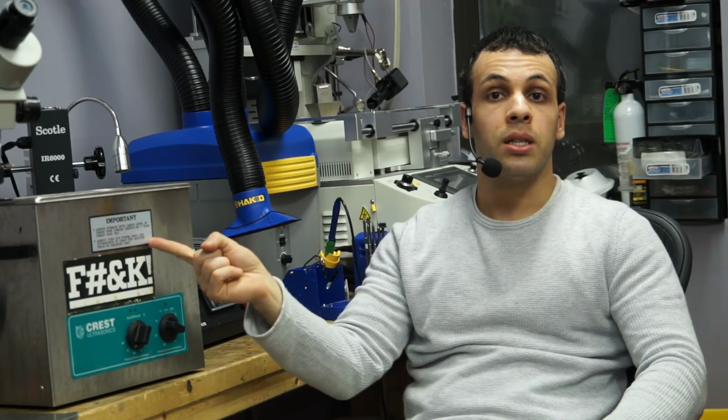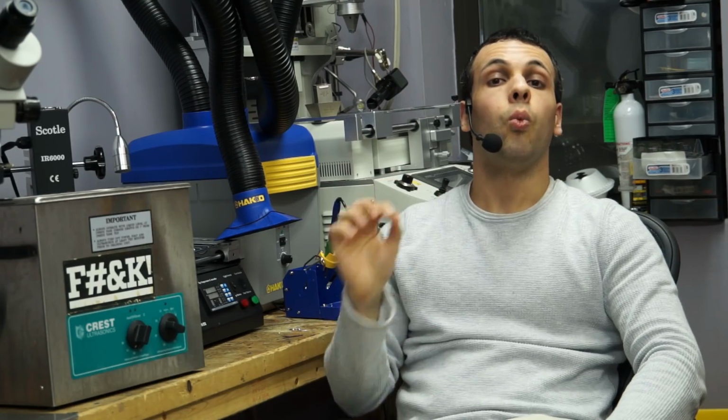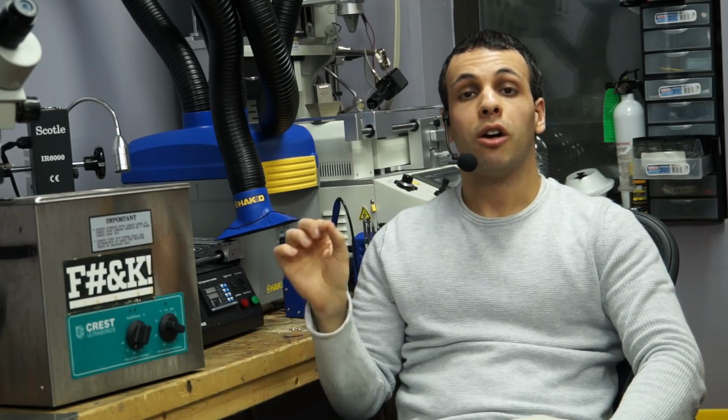Fourth, buy Branson EC. It's a very good cleaner. Do not pour the Branson EC in here. You pour the distilled water in here, and then you pour a very small bit of Branson EC in here. How much of the Branson EC do you put in? I just wanted to see if you were paying attention and listening. But in case you weren't, 103 milliliters of Branson EC to 1 gallon of water.